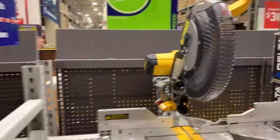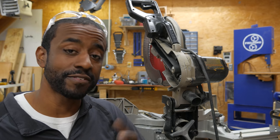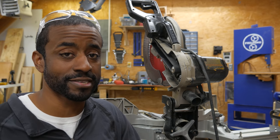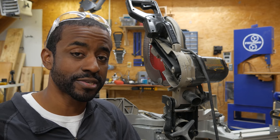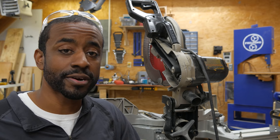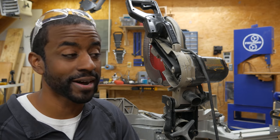The problem is they're terrible at speed control, and that's why speed controllers don't come standard on miter saws like this. However, we're going to try a couple of things before we do more drastic modifications. The first one I want to try is controlling the voltage. I don't think that's going to work, but if I don't show you that, I'll get a thousand comments asking why I didn't just turn down the voltage. So let's try it and see what happens.